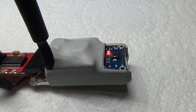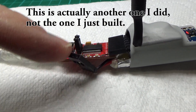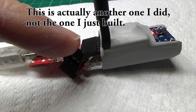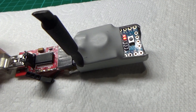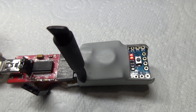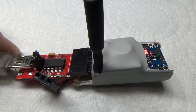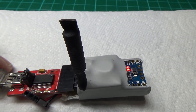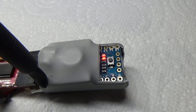It's all done and programmed up. As you can see I've put a connector on there so you can just plug it in — it's actually running off the FTDI adapter at the minute at 3.3 volts. In the configuration I've put as many variables as I can so you can set the pause time — how long it actually takes before it fires up.